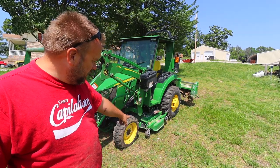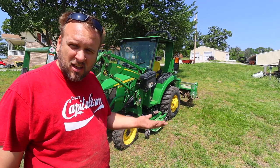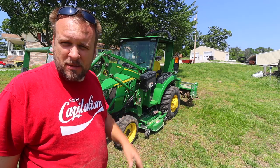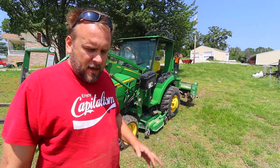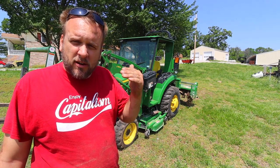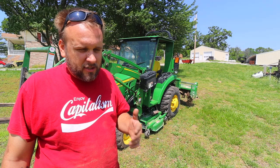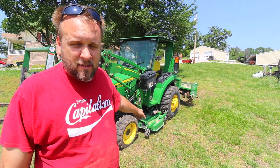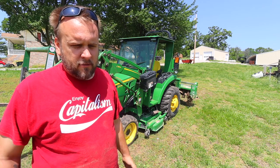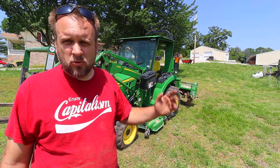You've got some gauge wheels that I sometimes forget. You're supposed to move those gauge wheels up and down. I think they go all the way up when you're loading the deck, and you move them down to keep it from scalping. But I would say you can give credit where credit's due without saying something's perfect. And from an engineering perspective, this is impressive that there's no manually moving the deck, fighting with the PTO shaft. I didn't even get my hands dirty. It was quick and easy.